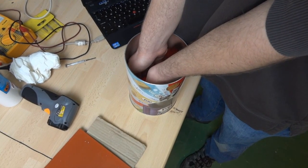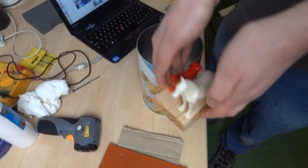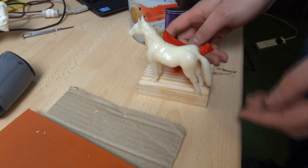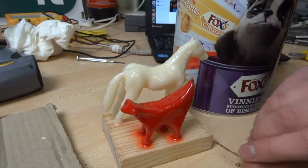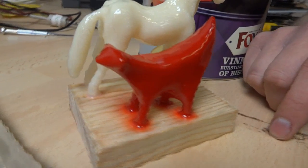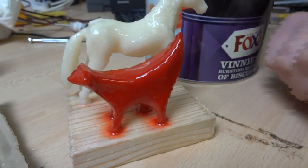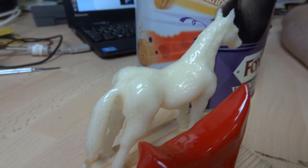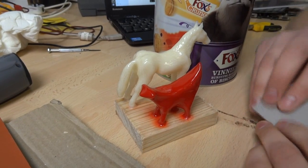It's cold. Smells like ABS as well. Those are definitely shiny and smooth. I'm not sure if we've got rid of all the details on the horse, and it's not so good higher up, because the acetone vapour didn't rise so far. But this one's definitely good — super shiny. This one did start with a narrower layer height, so this was 250 microns. So the horse isn't too bad — it's definitely glossy all over, and it's got pink feet.